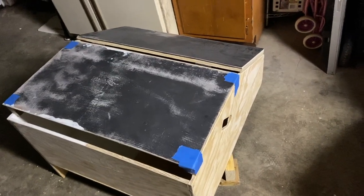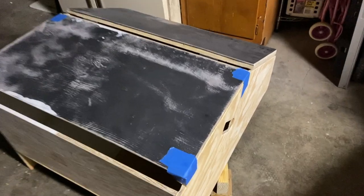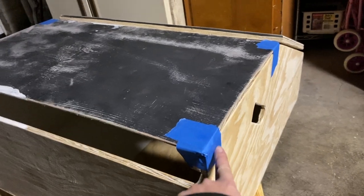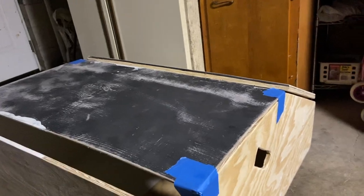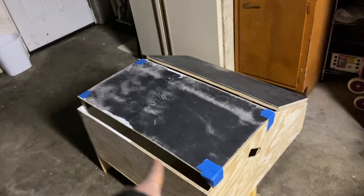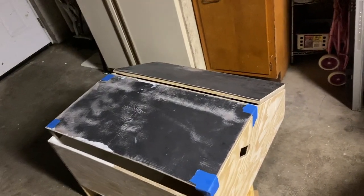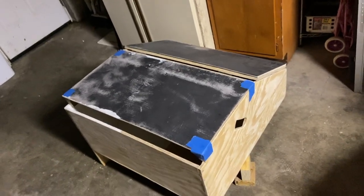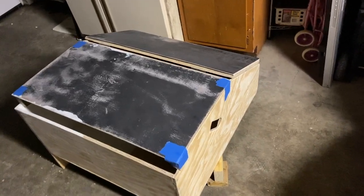One thing I also did is I laid the cabinet on its back. That way I have gravity helping out a little bit. I went ahead and let the magnet attach to the one that I had already glued on this piece. And then I just added the glue and sat the board on top. Then I just made sure it was lined up properly. I made sure that the lid section would open without impeding on where this position will be once it's all set. I believe I have it in a good spot. I think it'll work. After this, the only thing left to do to this will be some light sanding and then some primer and paint, or maybe I'll do a primer paint combo.